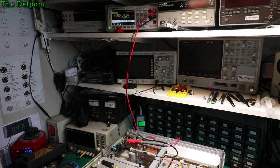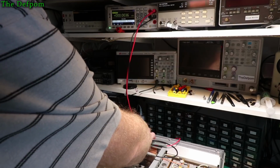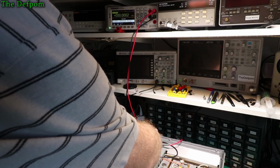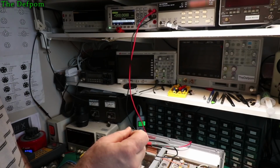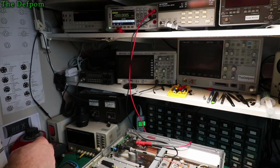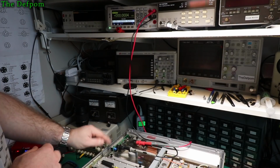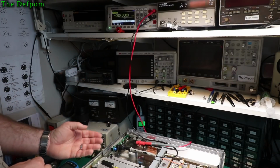Right. Shut that off, that's driving me nuts. I really need to get the fan done. I'm waiting for a new fan to arrive. Once the fan arrives, I'll be changing it, obviously. So the plus and minus 5 volt rails are both slightly out of spec. Just very slightly. So I might actually have to look at what can influence that. I may have to tweak that 15 volt rail, see if that affects them, even though I've now got a 15 volt rail bang on.